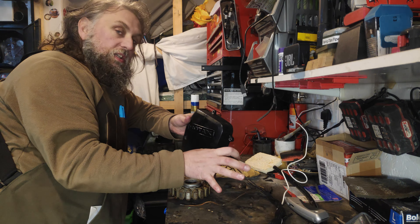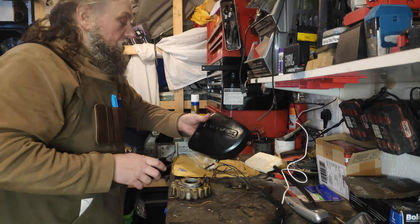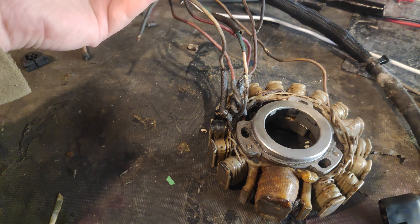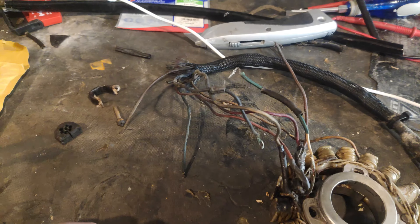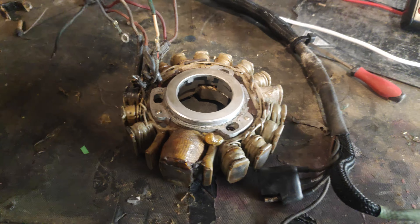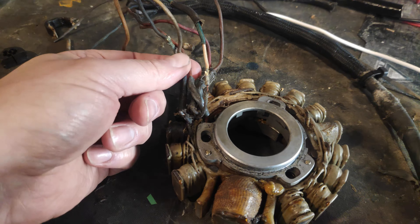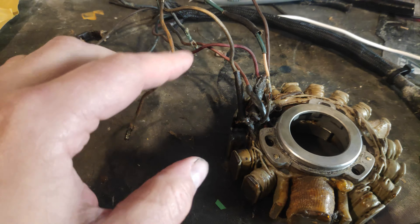Completely all of this wiring is solid, hard, and crispy — it's had it. Not only that, when I looked into it a little further, the green snapped completely. The colors are really not well preserved at all. The orange has gone there, and this is like an enameled wire leading directly out of the coil.